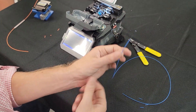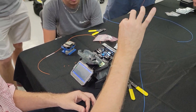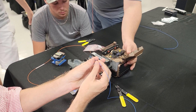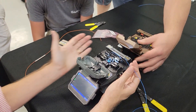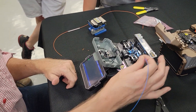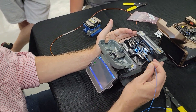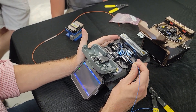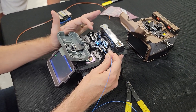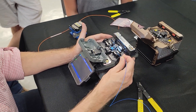When you set your fiber in, you have to kind of measure it. Notice the curl — it says curl to the right, curl to the left. When you're dealing with 900 micron fiber, you have to work with that curl and make it as flat as possible. I want my fiber to end up halfway between the V-groove and the electrode. That's what I'm looking for — that's where you want it to land after you cleave it.